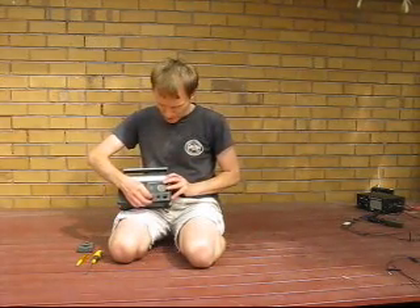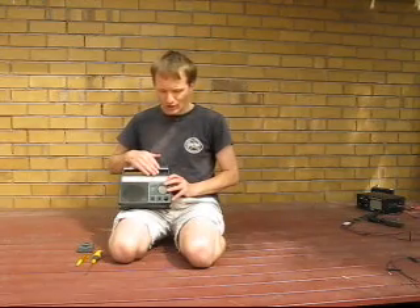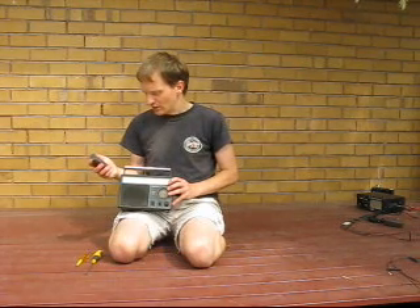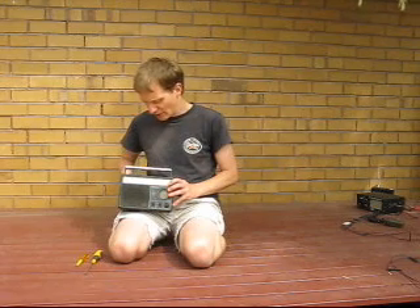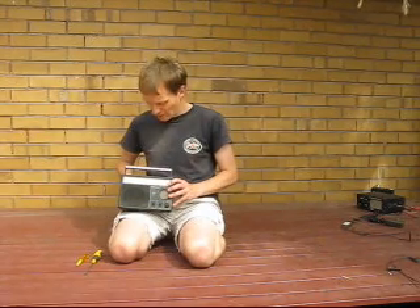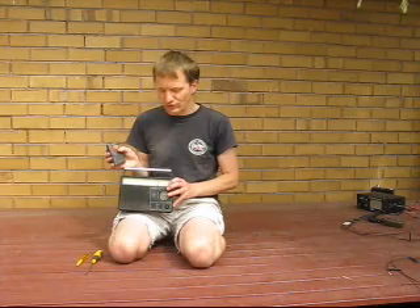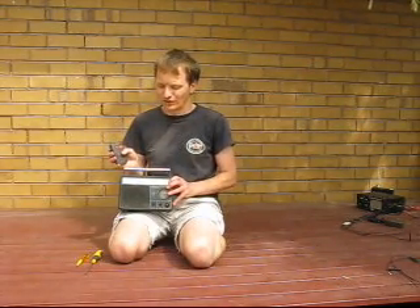The first step is to put the receiver that you want to convert on a blank frequency around 1600 kHz, or 160, at the top end of the dial. Just turn the volume up. We tune the second receiver around between about 10 and 14 on the dial, and we have to hold it right up close to the receiver we want to convert — tune across and we'll hear it go quiet. What is happening is this second receiver is acting as a signal generator, and it's being picked up on the receiver that you want to convert. A bit under 1200 kHz on this dial, about 1600 on this dial — the difference is about 455 kHz, give or take.